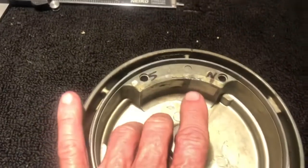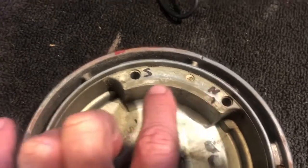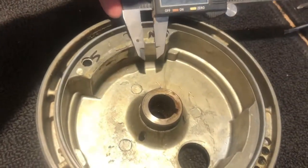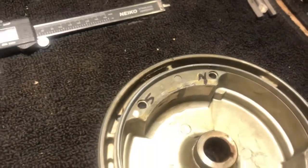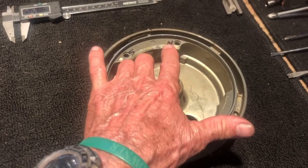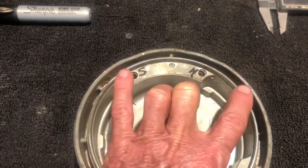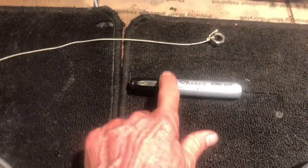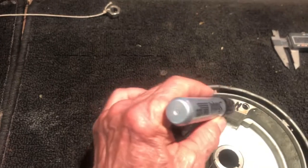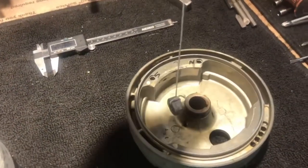On each magnet, I found the north and south poles with the Tesla meter. Then I took a caliper and marked out 10 millimeters from the edge of the north pole. The reason for that is I think it's important that when measuring each magnet you measure the same spot, because as you move the meter in and out or left and right, the readings change due to the EMF field lines changing. We're going to mark the reading on each flywheel with a magic marker and see what the results are.